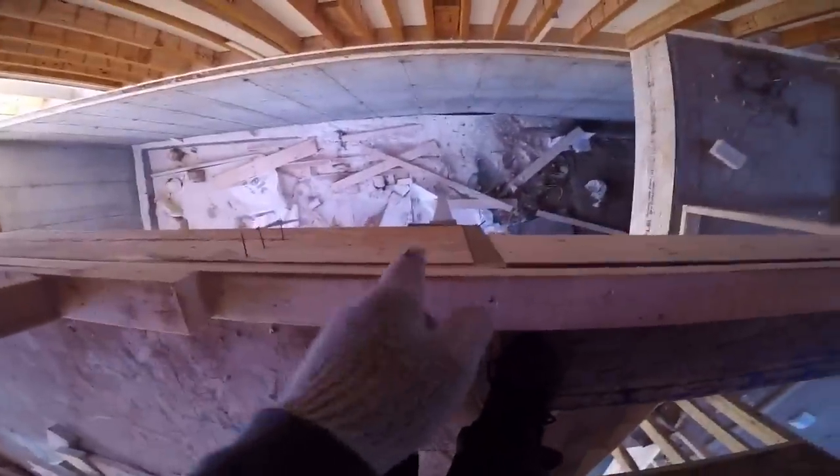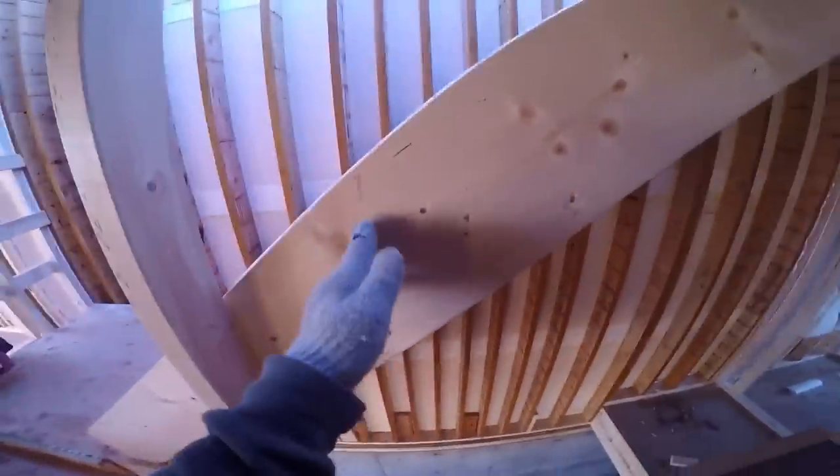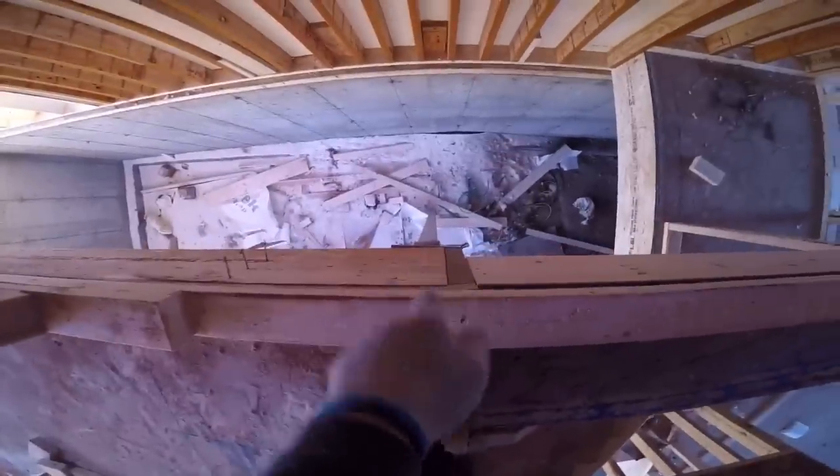Now for the post I wanted to land right on this metal post here, so I'm gonna put the post here. It would be nice to put it on the end of the wall right here but I'll just put a stud on the end of the wall and then put the post about here, and then it will transfer down to this steel post down there.